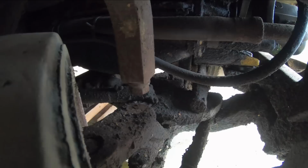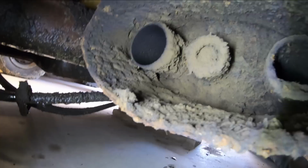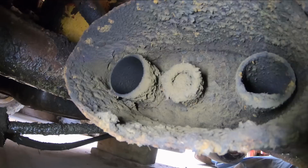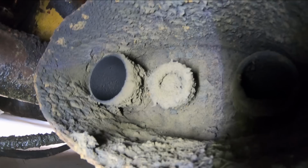Moving further forward up here on the machine, we have the exhaust, or what's left of the exhaust. As you can see there, the whole front of this muffler is missing, and that's why this thing sounds like a dang Harley Davidson sitting here idling. It's supposed to come in, make a loop, and go back out and vent out to the back of the forklift, but the front's missing here, so it's just deadheading out here right into the tire and echoing off the ground and everything. It's being really loud. So the shell of this actually feels like it's still got some meat left to it, so maybe we could patch it up in a worst case scenario.